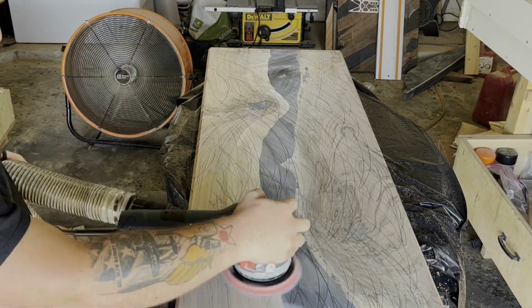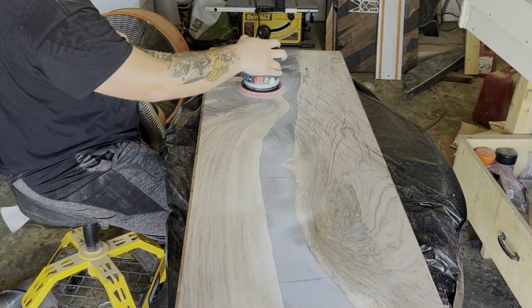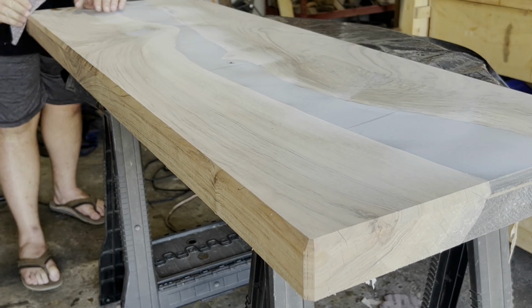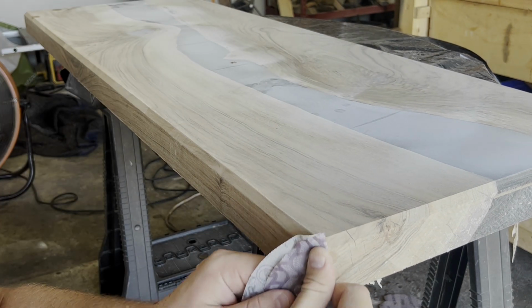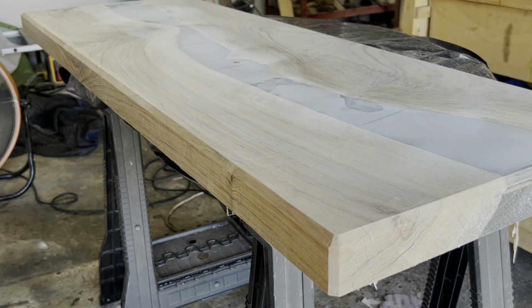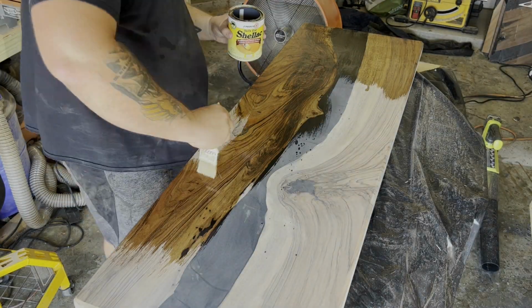From there, it was pretty much business as normal, doing the finish sanding, going all the way up to, I think, 120 or 220. Sanding these edge profiles very, very delicately, because if you were to mess up the proportions to that 45-degree edge and that 90-degree edge, it's going to be a lot more noticeable than if you mess up that small roundover that people normally do.